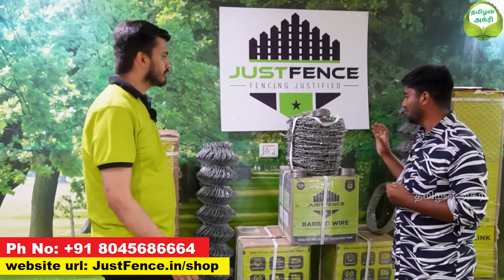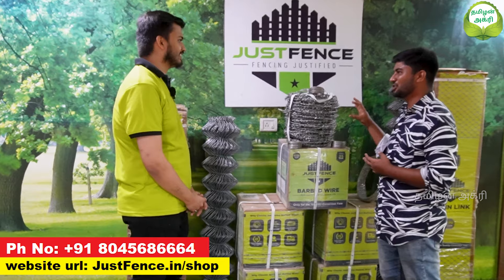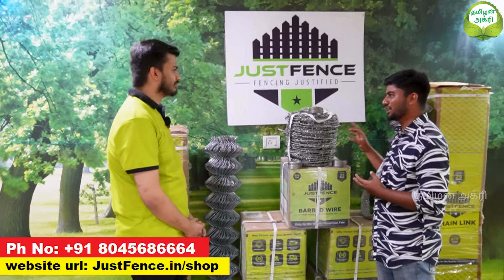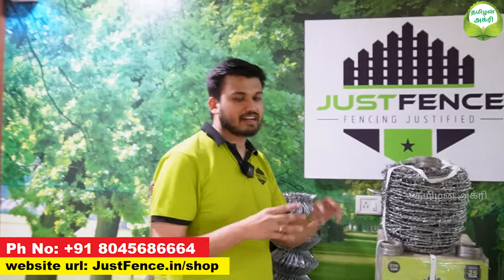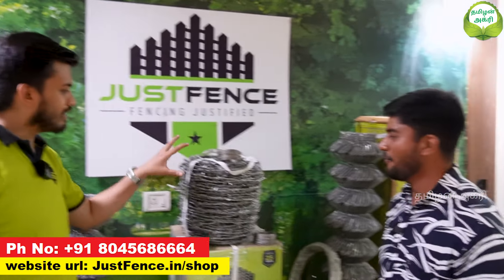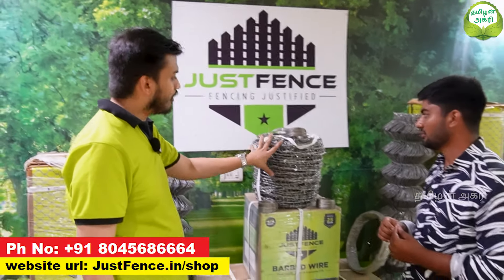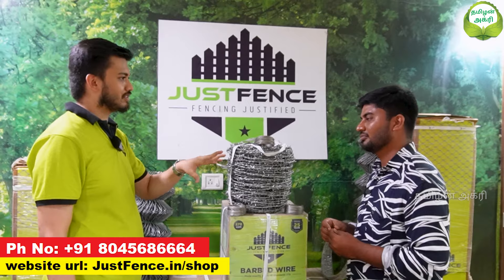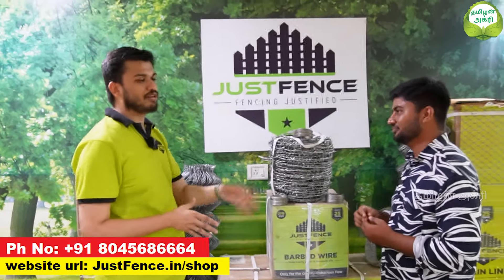If you are looking for fencing, at one time there is 10 to 20% mirror fencing, but some products have black patches. What is the reason? Other products in the market mix aluminum with zinc for a shiny finish. If you do that, the product will shine, but the zinc content is less and product life is much shorter. Here we are using pure zinc, so the finish will be dull. But for product life, it is much better. Other products go black within one or two years.